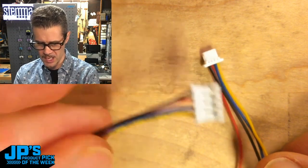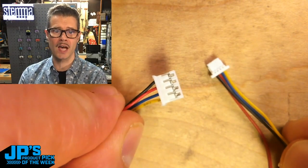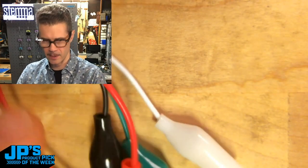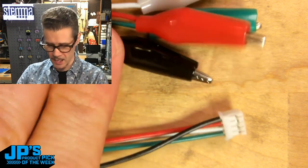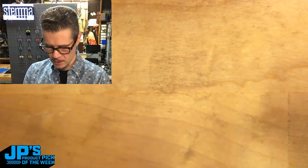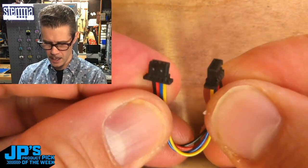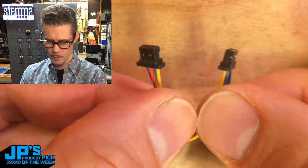What we've got here are a few different connectors. This is the JST PH, and this is the JST SH. This cable allows us to connect full-sized plugs to smaller-sized boards. We've got things like this four-pin JST to alligator clips, which is really convenient for hooking up between, say, a sensor and a board such as a Circuit Playground Express that has alligator clip pads. Here's a standard three-pin to three-pin connector. And this is the little JST SH-sized — what SparkFun dubbed the Qwiic system and what we call the Stemma QT — using I2C over these four cables with these teeny little connectors.